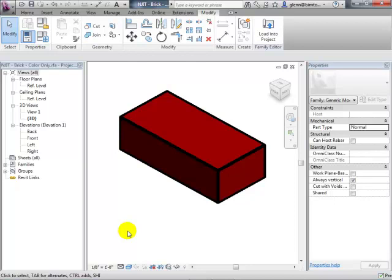So it's ready to use, but we're going to go ahead and keep on going. In fact, it's a good general principle. As I go through and build parts, I tend to build them very incrementally. I'll change one thing about them, see how that works, then change another thing and see how that works. Don't go in making the world's most complex part and test it right off. It's good to do this very incrementally and see how things are going.